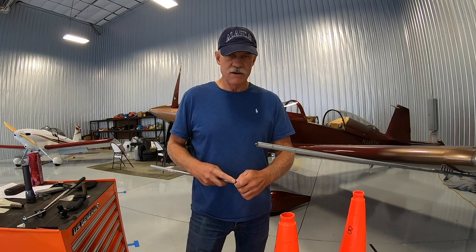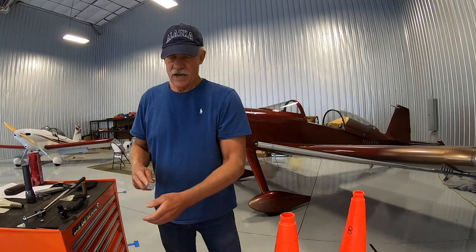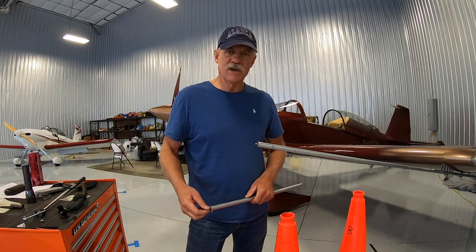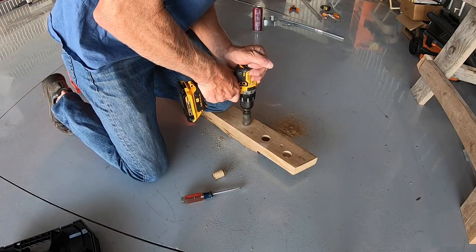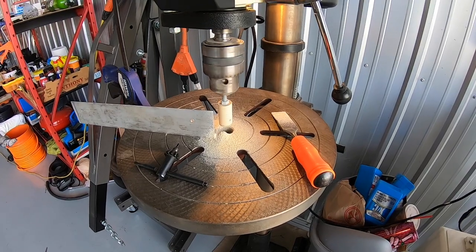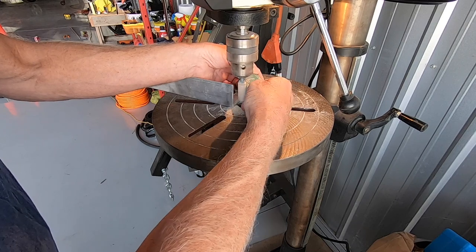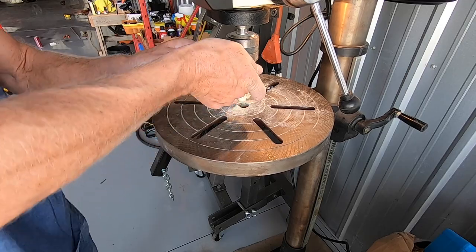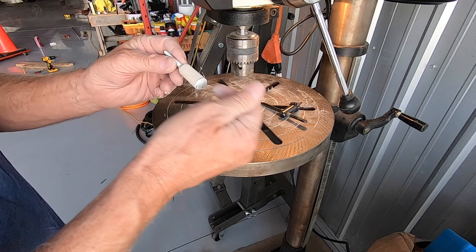By the way, I use JB Weld now — I used some other stuff early on, but JB Weld's the easiest. The last way I did it, just recently, is I found the smallest hole saw I could in my toolbox, then I drilled a core out of a 2x4, put a quarter by 20 bolt in there, and chucked it up in my drill press and used it like a lathe. Just be careful if you haven't turned any material on a lathe before — make sure you have a good tool rest and a sharp chisel, and just take your time.